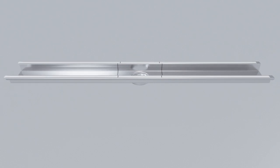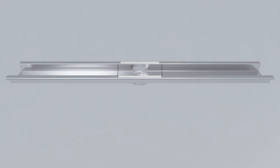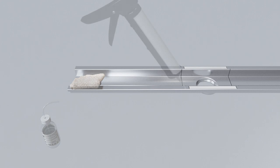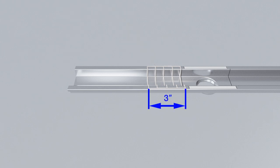Remove the drain and side trays from the shower enclosure. Without removing the film, peel the protective film up to the markings. Cut the protective film at the inner markings. Clean the drain surfaces with cleaning solvent. Do not wipe away the marked lines. Starting at the marked lines, apply sealant about 3 inches from the traced line on the inside and sides of the drain.